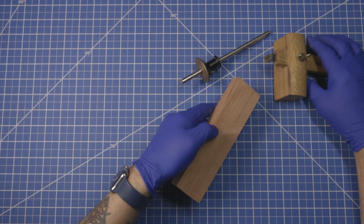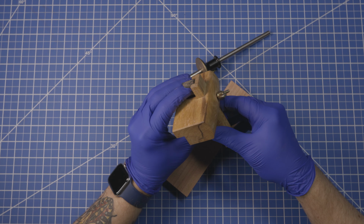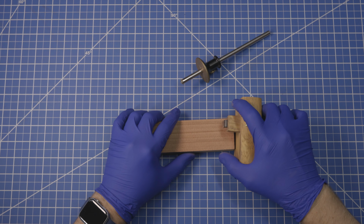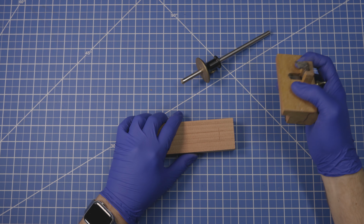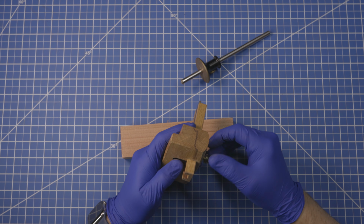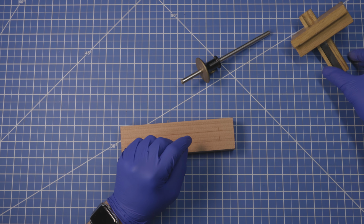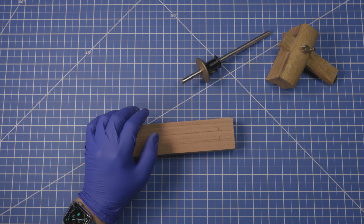The advantage to this too is that you can actually retract the inside one and make it so that you only have one blade out. So, for example, if we were marking the top of this mortise, you could do that with that single blade if you wanted. There are advantages to a marking gauge as opposed to using a pencil, or there are marking gauges that allow you to mount a pencil and draw a line with it, to use the fence as opposed to setting down a ruler and making a mark.